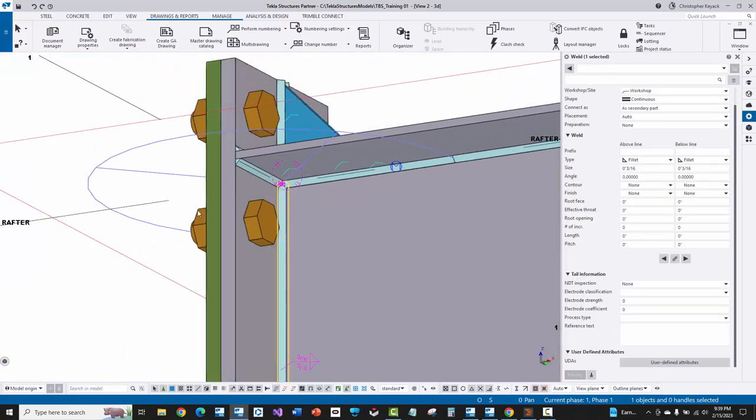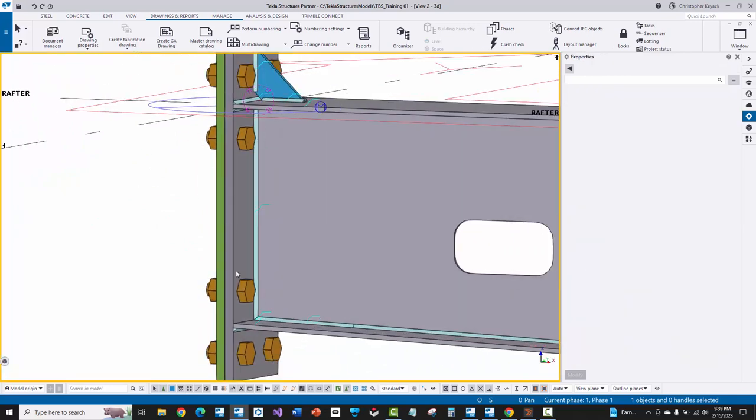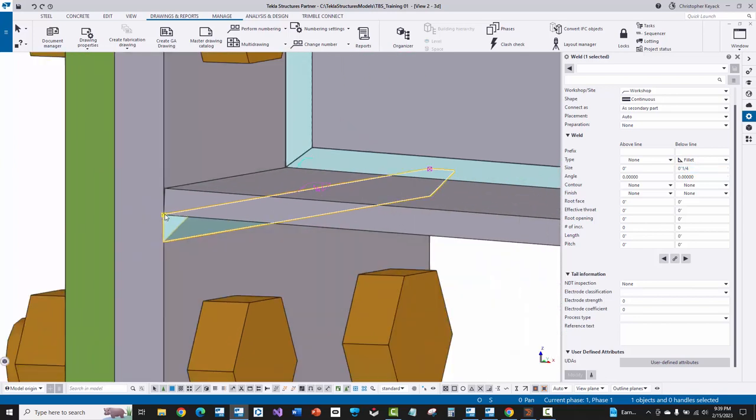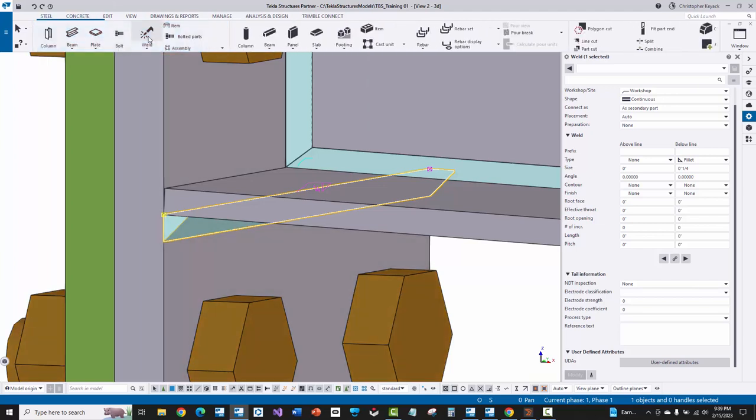I did create a few different testing scenarios. This is a quarter-inch fillet weld and it's only on one side. I'm using polygon welds everywhere. The AGT export software — if it sees Tekla's normal simple welds rather than polygon welds — what the AGT export will do is actually select all those welds and convert them to polygon welds.